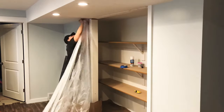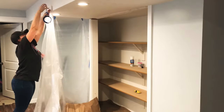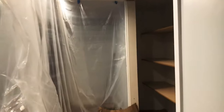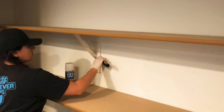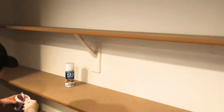I really hate painting, so after some thought I decided to try spraying these shelves since it was kind of contained in the closet area. I hung up some plastic curtains to keep the overspray in and put paper all along the floor — there was still a little bit of dust, but it worked out pretty well. Next I spackled and filled all the nail holes first.